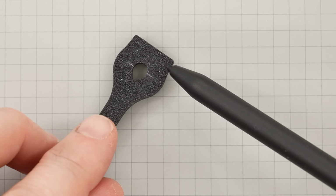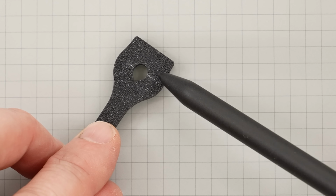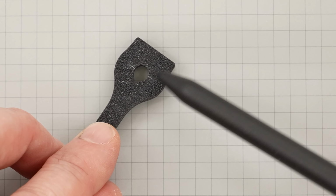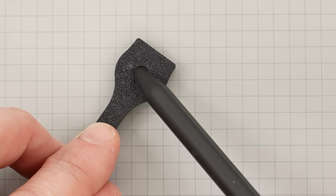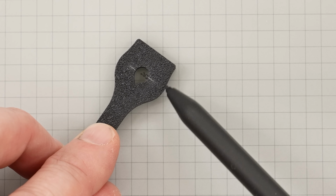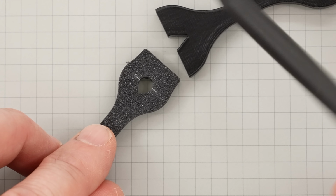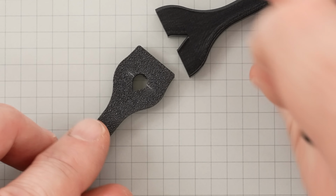If you look closely at this, you can see the lighter colored plastic here adjacent to the hole. And that lighter colored plastic, this is ABS, is where the material was stressed, where it was actually stretched. And you can see that it's stretched right next to the hole, and there's very little going on out here. So all this additional meat that I added to the part, especially on this one, that's out here much further away, it's not really doing anything because all the force is being carried through the plastic right next to the hole.